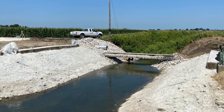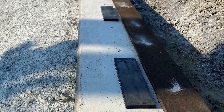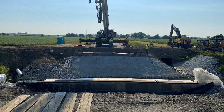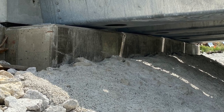The bridge size was 26 feet 8 inches wide and 57 feet long, no skew. The substructure was a 12-inch metal shell piling driven into basically a silty clay — about 35 feet long to give us a good base to sit on. Then we poured a standard concrete abutment on top of that with riprap out in front.